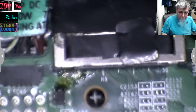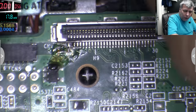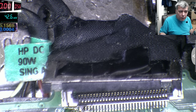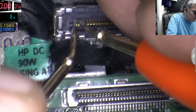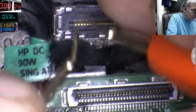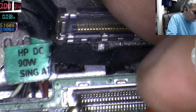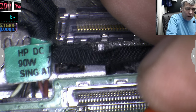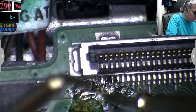So what I will do, I'll take the charger out, I'll take the connector out, and I will check on the connector if those pins are together, all three pins, yeah? Let me switch the multimeter on diode mode. No, this is not together. This is not together. So this pin is going here. But this is strange, you know, only one pin for 19. This is weird.